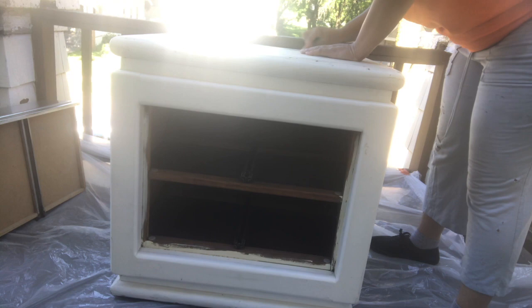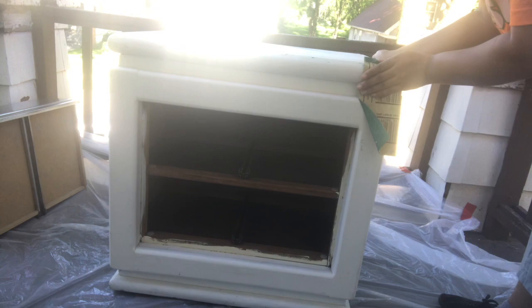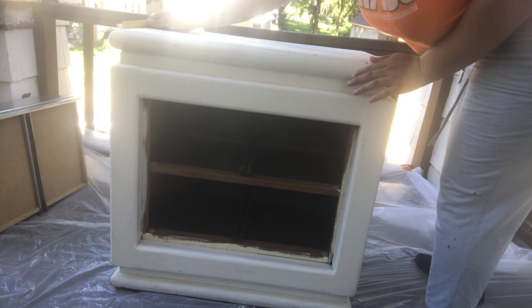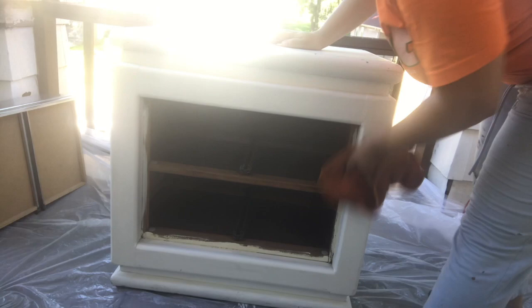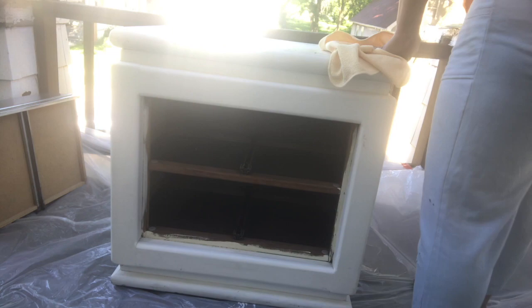In this clip I tried to give you some more sanding on camera using the 80 grit, making sure all the sides are really good. This furniture didn't have a lot of dents or damage like some other pieces I've gotten from Goodwill or Restore. It was very well taken care of — I just wanted to sand it down because it had paint already on it to make sure my new paint would stick well. Then I wiped the dust off again with microfiber cloth towels.